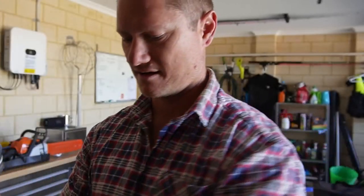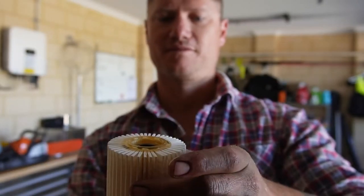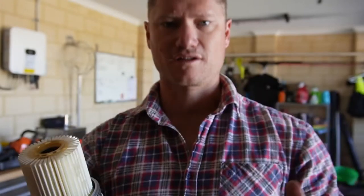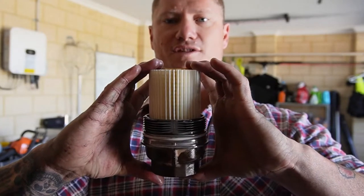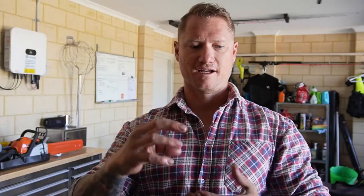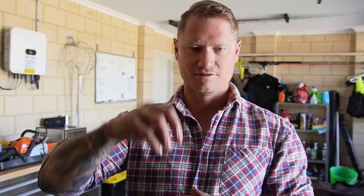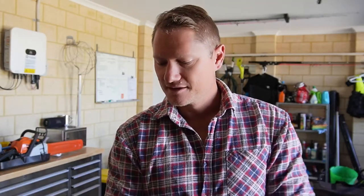That is ready to go. Get your filter — I always go writing out — and that just slides over the top of the spindle on the inside there. What I also like to do is check the springs in the actual cap itself: just give it a nice gentle push down a couple of times. What that does is indicate that it's free to move, nothing's going to catch on the spindle, there are no burrs that could potentially ruin the integrity of your filter. That is ready to be reinstalled.